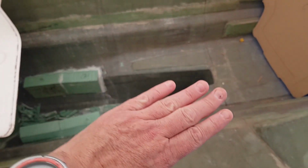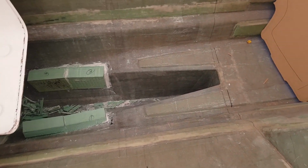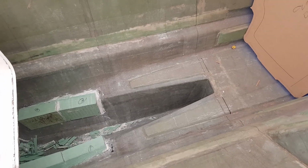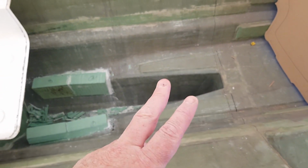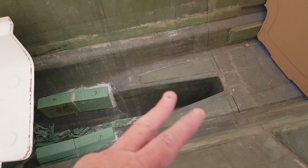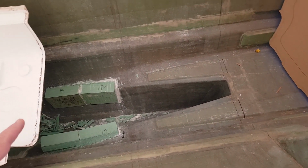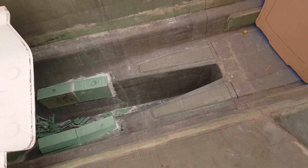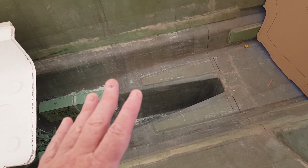By removing them, I'm going to get it to sit flush, and then I can work out the exact height of these with my timber bearers on top. So I'm going to get in and cut these out. It's a prick of a job with an oscillating tool, and then basically got to grind it flat and then re-laminate another 6 layers. So I've got to do a 300, 1200 quad, 300, 1200, 300, 1200, another 1200, and then basically beef this up and make sure that it fits in and lowers down onto the actual hull to the correct laminate that we determined without the foam.